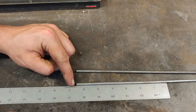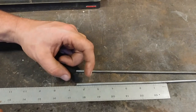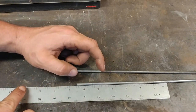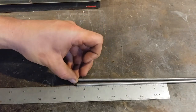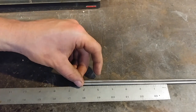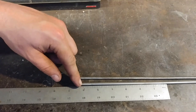The reason we need that difference is it will leave about three quarters of an inch on each end to draw out to the full eight inches of total length before we make a hook. So the first step is we will cut six bars — or seven or five, whatever floats your boat — all at six and a half inches in length.